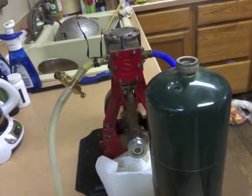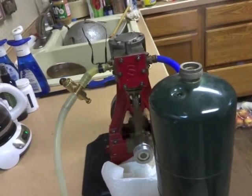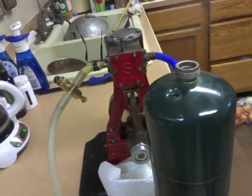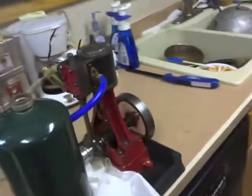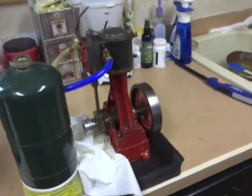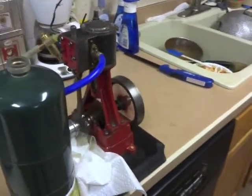I do have a leak around my inlet fitting that I made, and I should have put some Teflon tape on the threads. I couldn't run this all week — I had to wait to get a five-sixteenths-forty die so I could make a fitting for this inlet.